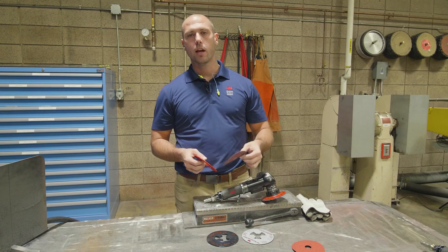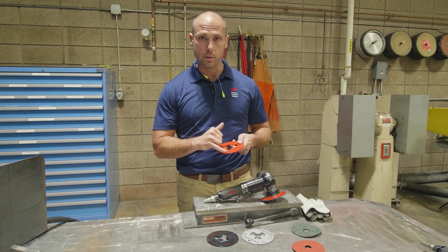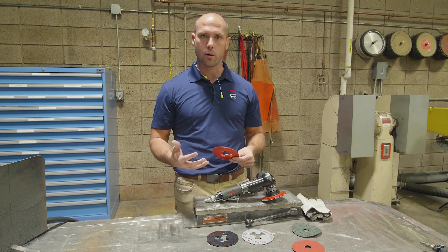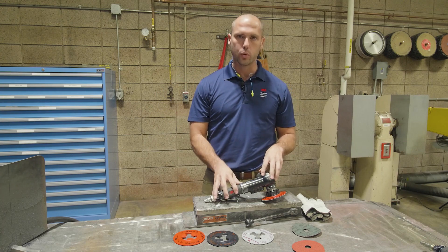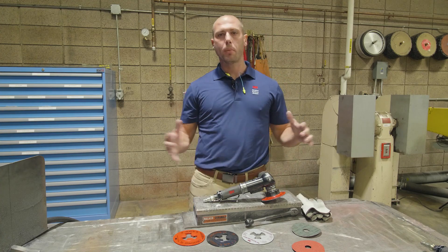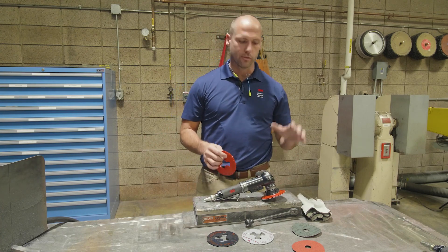This mineral is very tough and it needs to break down — the harder the backup pad, the better. Our backup pads have ribs which help create pressure, break the mineral down, keep it self-sharpening, and keep it cutting longer. Another thing people often overlook is the tool itself — you want a very high-powered tool to run these abrasives. Think of it this way: you could buy the world's greatest guitar, but without the right amplifier it won't sound good. The backup pad and tool are the amplifier for this abrasive.